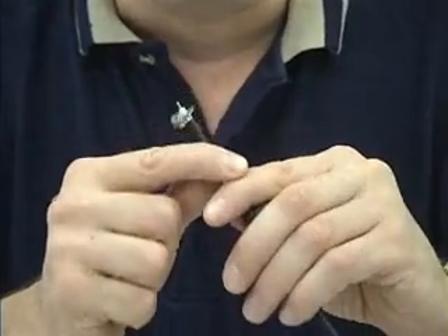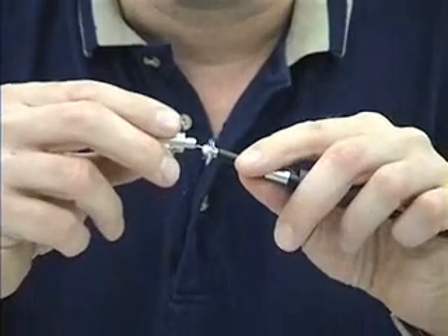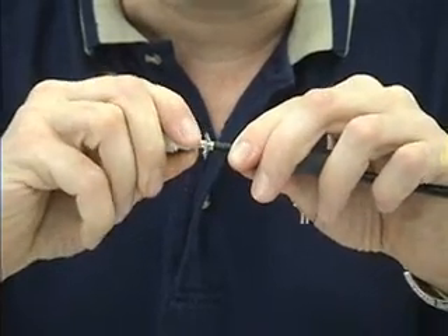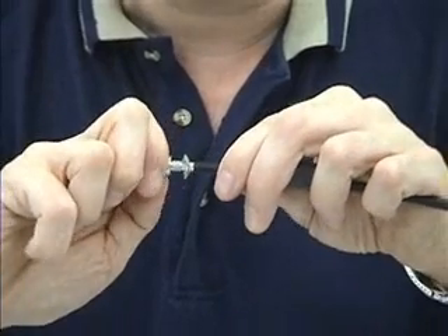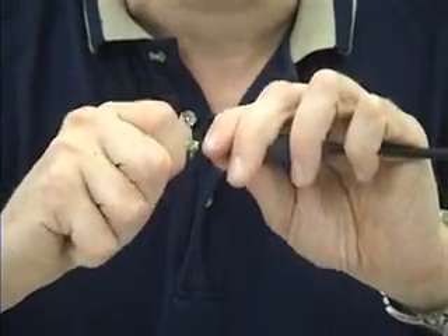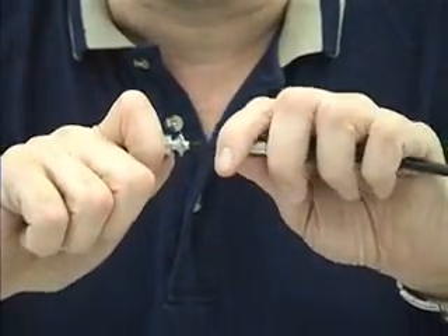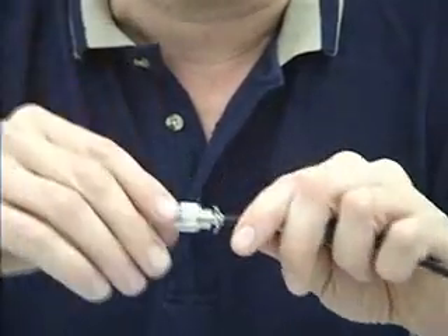You may have a dull blade — you never know — so it's just good practice to check. Take the connector and gently get it started over the outer conductor, spinning a little bit to make sure you have a good start and aren't ripping into the outer conductor. Push gently and turn gently until you feel it stop — at that point the beryllium copper spring finger is just making contact with the center conductor. Give it a little extra push to slide those fingers over the center conductor.